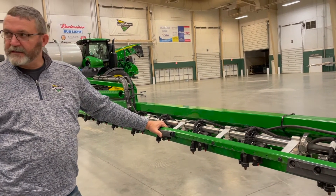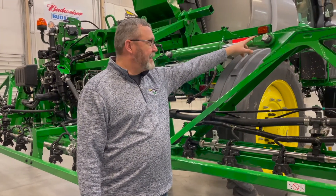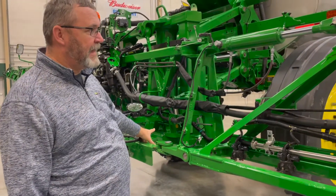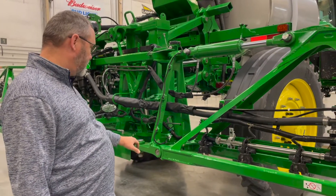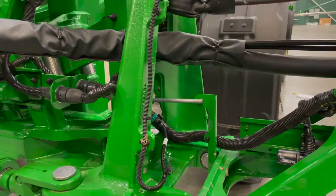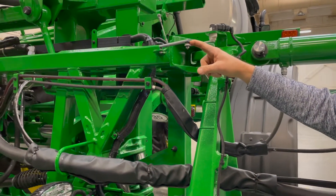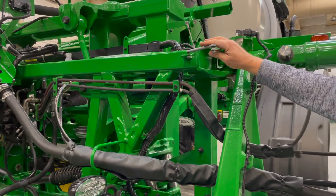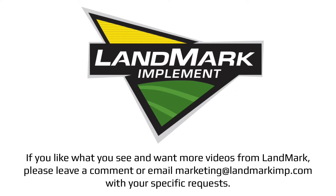We have a whole section on Exact Apply that we'll go over — this just happens to be an Exact Apply boom. We've gotten away from the issues with the boom fold eyelets; they really updated the clevis pin on these boom tilt cylinders and boom fold eyelets. There are still bushings that need to be maintained in the tilt and fold cylinders. On the back here, these are our sensor rods for the boom fold and tilt sensors — once in a while if you have trouble with your auto fold, these little rods will pop out of their ball and socket. Those are easy to check first before you call us, and we carry replacements at our parts location.